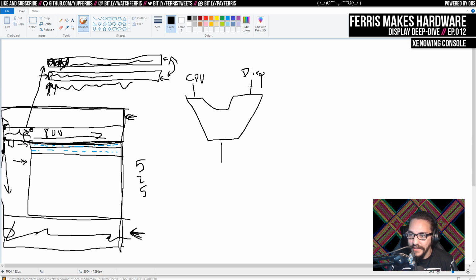And there are a couple of things missing from this display interface because it's only doing reads, whereas the CPU is also doing writes. But it doesn't really matter, because if the CPU is trying to read or write, that will be blocked by the display. So essentially, both of these just interface directly to the bus as they think it is. But there's this ready line that the bus exposes, which we can also exploit. So we can basically say if the display is trying to do anything, then we're just going to tell the CPU that the bus isn't ready, and then block all the CPU signals.